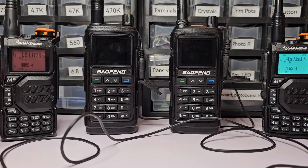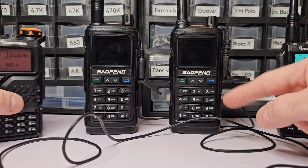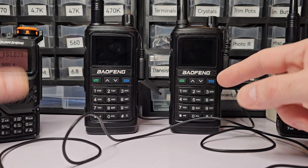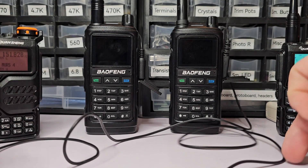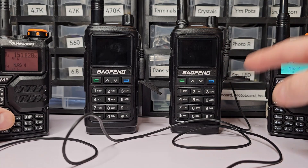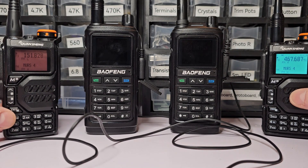It's important that you don't do this on the same band. You can't do it all VHF or all UHF — it has to be cross-band, because it's the separation between UHF and VHF that allows this to work with just a simple wire and no special equipment. Repeating on the same band requires a lot of special equipment and is very difficult to do.